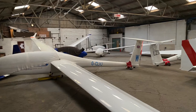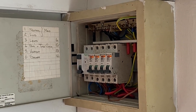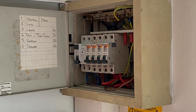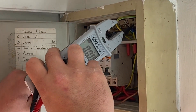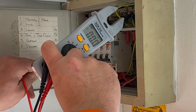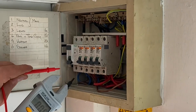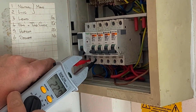Now we've re-terminated the plug top. We're going to recheck our first live test of polarity of supply — this is the reason why we do it and people tend to skip past it. Going to our earth bar and line, we have 232 volts. Earth bar and neutral — this is where we had voltage before — we now get next to no voltage. Between neutral and line we've got 230 volts. Polarity is now correct.